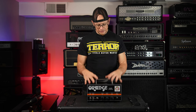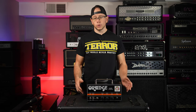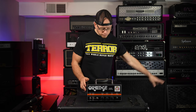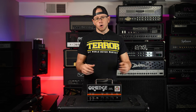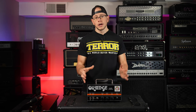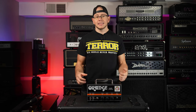Yeah, I'm not sure if my microphone will pick that up, but I'm definitely hearing some sort of electrical buzzing inside of the amplifier. So our next step is we're gonna start pulling this thing apart. Now I'm gonna detach that power cable and I'm going to flip that power switch on real quick in hopes that that drains some of the power that's in the capacitors, but that is not going to drain it completely. There is a procedure to drain the capacitors completely. I don't know how to do it, but I do know that I can at least take this amp out